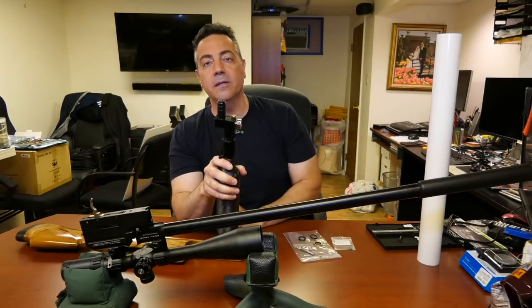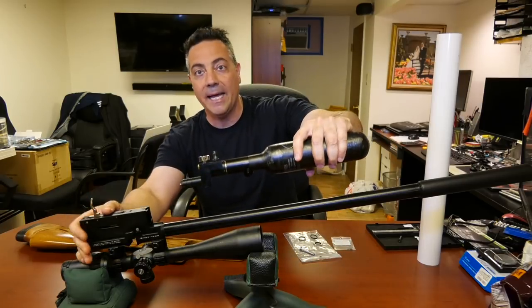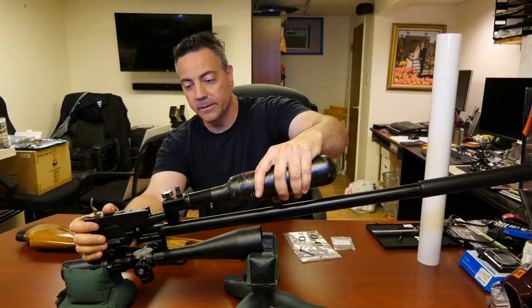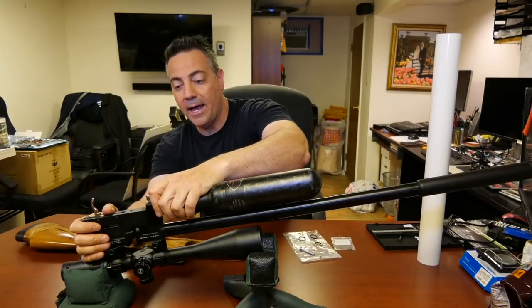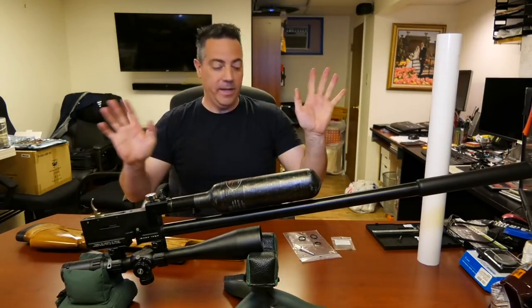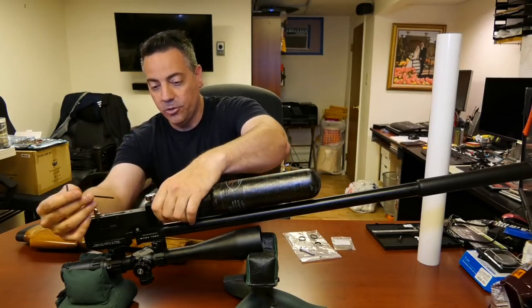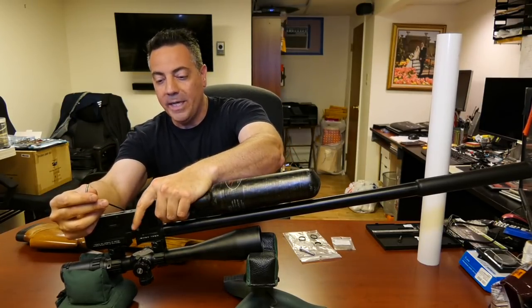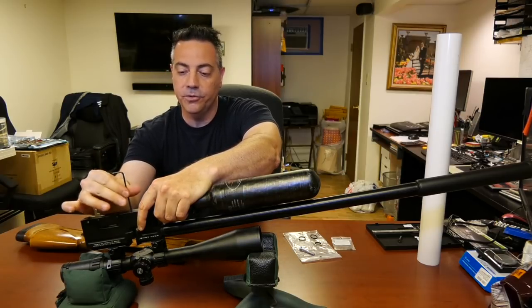By the way, I already have some silicone grease applied on the O-rings when you're slipping it back into the block. And if you notice, this is all hand tightened. Now, by the way, I'm doing this all unedited right in front of you. Make sure your valve is all the way into your block. Apply pressure. Screw down the grub screw.